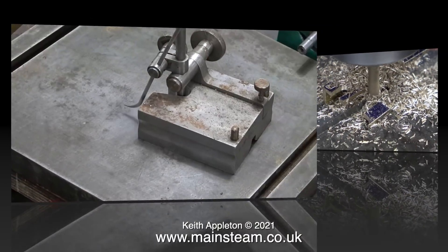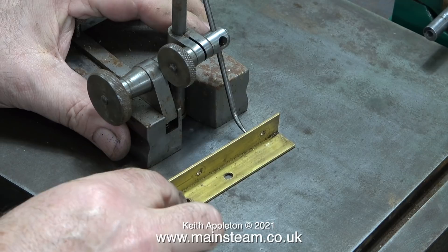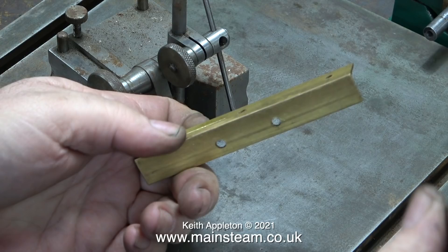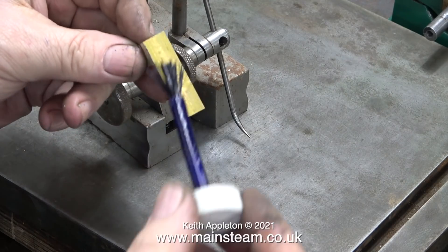Once I've finished the milling I cleaned up the parts on my linisher, and now I need to use this marking out gauge. It's not a very modern one — no digital stuff here — but at least there are no batteries to go flat. In conjunction with my cast iron surface plate, which is a known flat reference, all I have to do is measure five sixteenths of an inch from the surface plate to the point, and I can scribe a line exactly five sixteenths of an inch from the edge of the piece of brass.